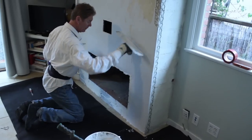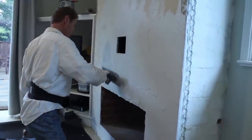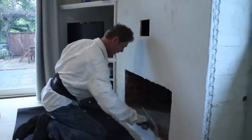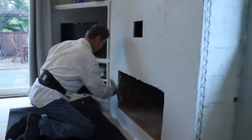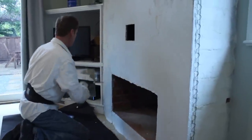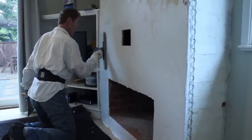I'm going to build this chimney out right here. The fireplace insert obviously is not here, which is good — if it was, I'd say take it out so we can do this. Down here there's no base coat. Is it a big deal? Not really, because this will set anyway. But that's where it takes a little more experience, because if you do it without a base coat it tends to want to blister or pop off. So you just have to know how to handle it, and I'll show you how.